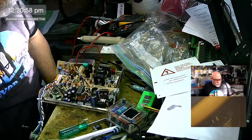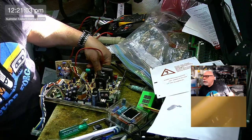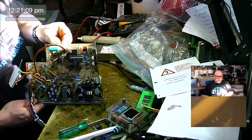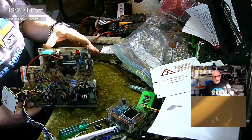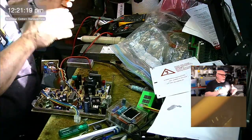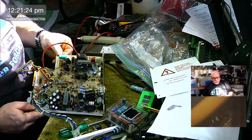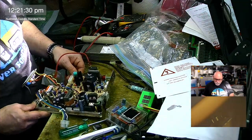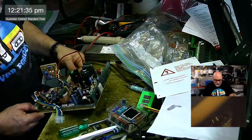Does it have the same flyback as the Plus? I recapped the classic analog board a while ago with those two caps, and I noted it had an old style Plus flyback, maybe a really early classic. It does. It absolutely does have the same flyback as the Mac Plus and the later sort of 128K and 512. The early 512 and 128 had a tiny little flyback, and then they put these bigger ones, and the bigger ones are on the Mac Plus as well. And yes, you are exactly right. It is that sort. I'm just not happy about the fact that I'm going to have to replace two of these, because they're very expensive.